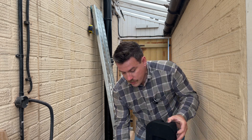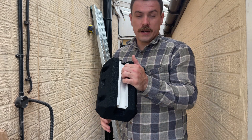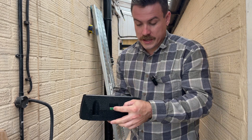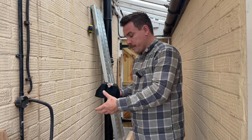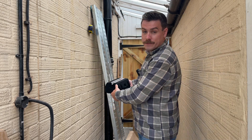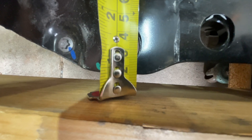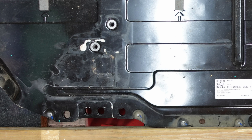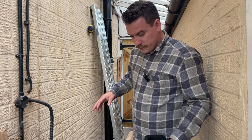I've got a longer one for the center, but at the sides I'm using these rubber mounts with a unistrut attachment. The rubber is softer than I expected if I'm completely honest. It's got a spirit level built into it, which I suppose you tear out afterwards. I'm going to have one of the smaller ones each side and then in the middle a longer one. The front of the Tesla battery — the middle part — has to sit slightly lower than the two edge ones, so I just need to get the position and depth right. I've got four feet in total, too many for what I need, but there you are.